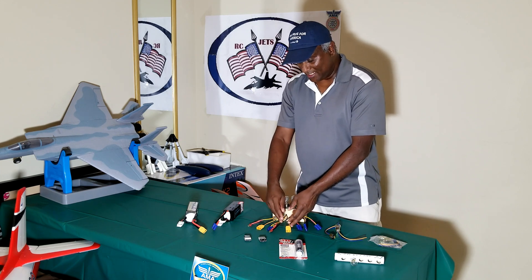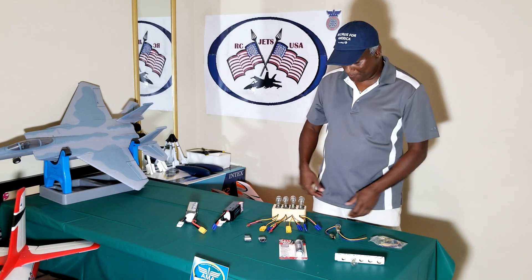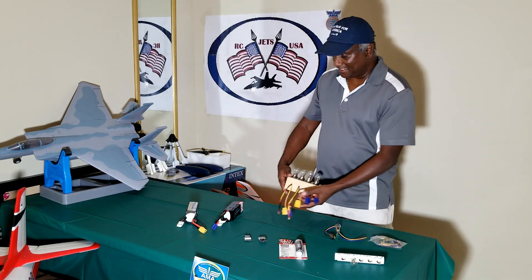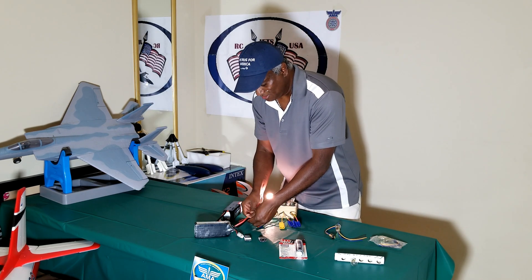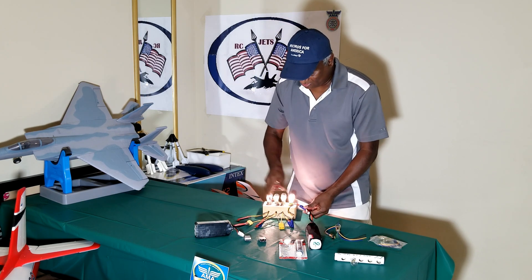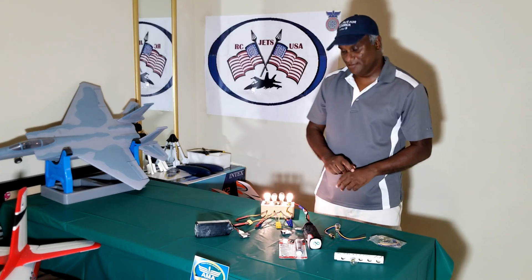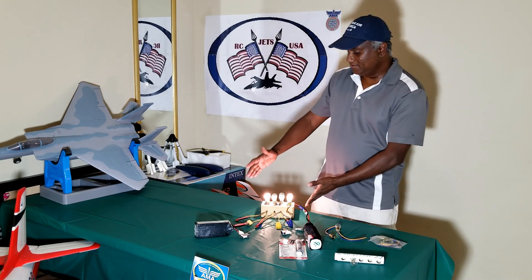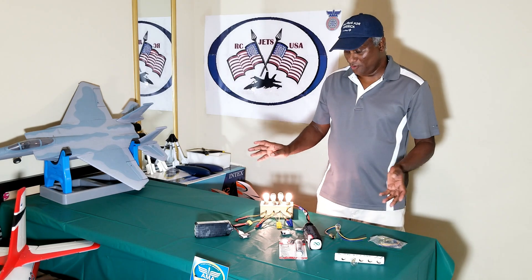It's not difficult to build and it is very useful. You can plug multiple batteries at once, like what I'm doing right now — connect one, then connect another, then plug in your beeper and make sure it's set to beep at 3.8V so you know when to disconnect. This is not something you can just plug in and walk away from — make sure you are always around to watch it, just like with any battery charger.